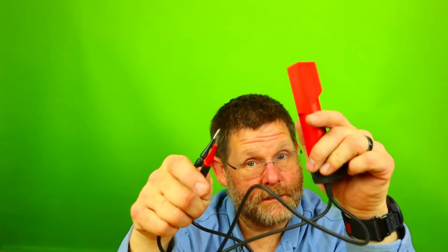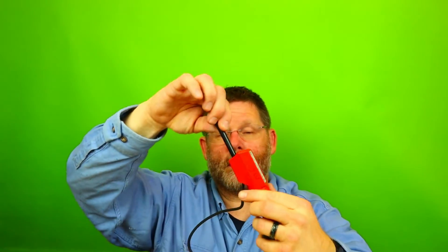I'm going to show you in a second — I'm not going to shock myself, but I'm going to show you that you can put either lead into a hot and get voltage, whatever voltage it's reading up to 600 volts. I keep reiterating that. Whatever voltage you're reading, you're going to feel it, especially when you're grounded. What you need to do when you use this — whether checking a motor or receptacle — get in the habit of putting your lead in the holder. Now you may say, well if I stick it in a receptacle and go to pull it out it's going to come out — and it will.